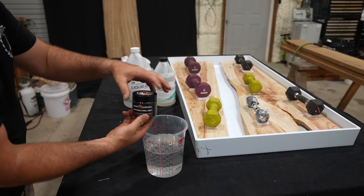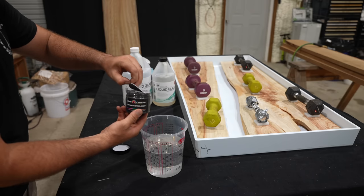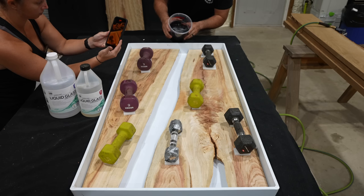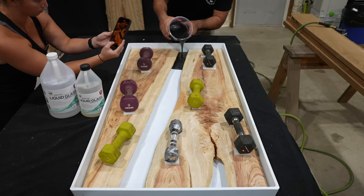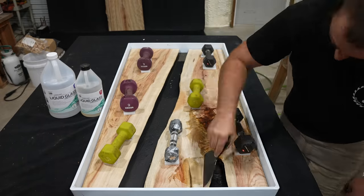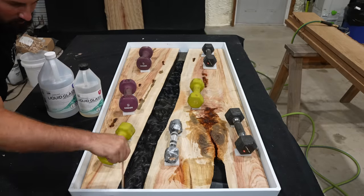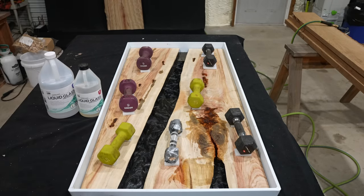For the color we're going to use Japanese Steel Gray from Eye Candy Pigments — you can buy these pigments directly from Super Clear's website. I like using the Super Clear Deep Pour 24 for these lock-in color layers because the epoxy starts to set up in a few hours, meaning less time babysitting and waiting to trap in the swirls. That's when you come back after a few hours when the epoxy starts to get thicker and swirl in some designs just like this.